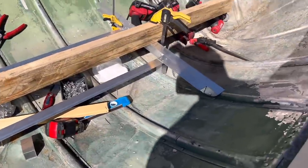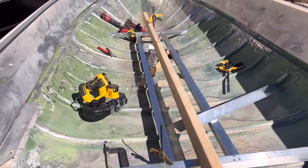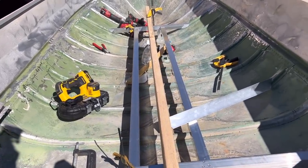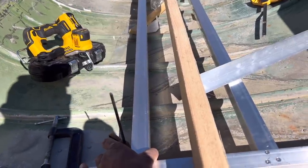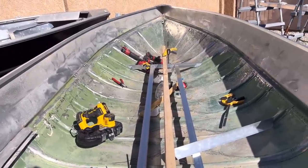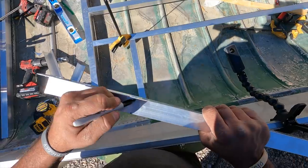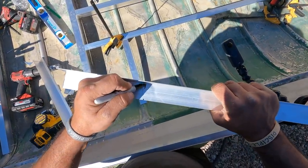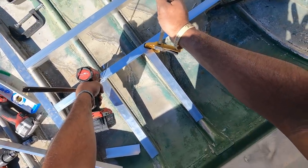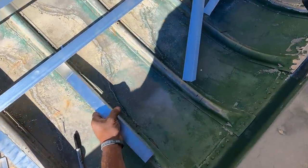So here we are. We've got the back beam, the forward beam, and a middle beam that ends at six feet because the sticks come in the package at six feet — anything over that is obscene for shipping. We have the lineups; this one can slightly go over there. We're just going to rivet that down and then run the cross beam. This is a very efficient way to use the aluminum — we'll have a lot of sticks left over to do more with, which is good because we need more for the framing. Keep all spare brackets, throw nothing away — you'll see why in a second.